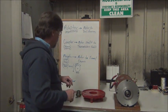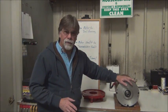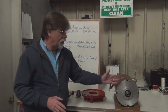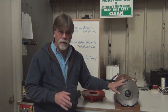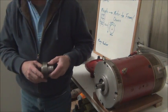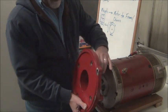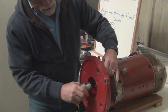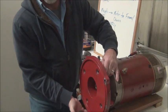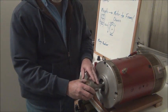What I'm going to do now is put the adapter on here, put the coupler on, attach the flywheel, and give you another view of what we're talking about with that magic number. In most instances we will attach the coupler first. The reason for that is if I were to attach the adapter first, it's going to be difficult to get in there and tighten those set screws and so forth. So sequentially, you want to put the coupler on first and then the adapter.